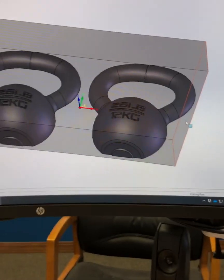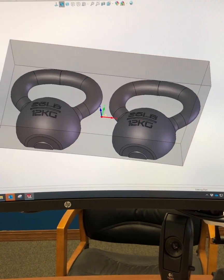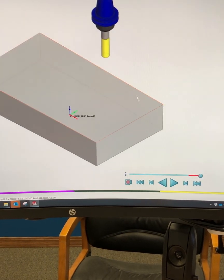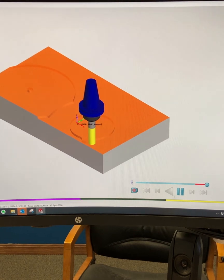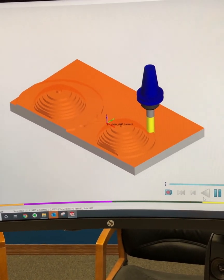I'm going to show you something pretty cool. What we've got here is the CAM software that does our 3D machining programming. We're going to run a simulation of our CNC machine right here on the computer so we can see the actual finish of this part after it's going to be machined. This is the actual model of the pattern that we're machining. We're going to simulate the machining ops — starting out with a three-quarter inch end mill that's going to rough it down so you can just see a rough shape forming.